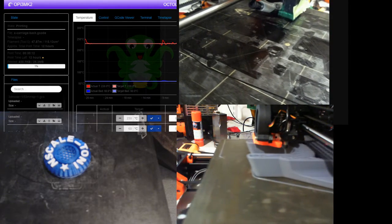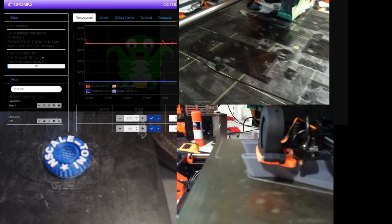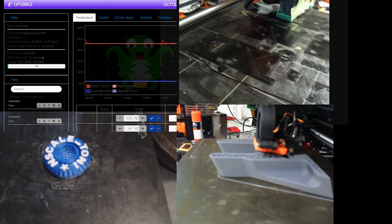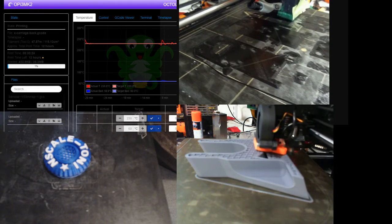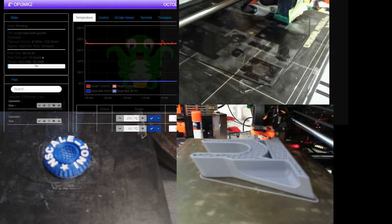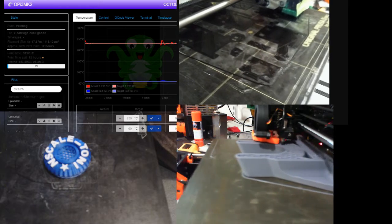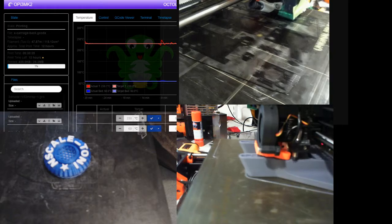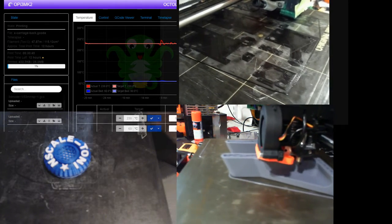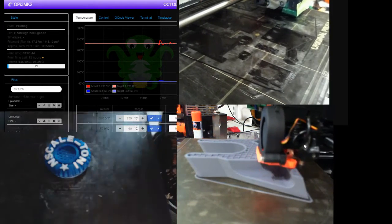Now, on a Bowden setup, obviously you use more than 2 millimeters because of the Bowden tubes, but you don't want more than 2 millimeters at the throat for retraction. So trying to eliminate stringing and keep it from clogging has been the big problem with that. In fact, I was printing some red and gold benchies. Let me go dig them out of the trash.